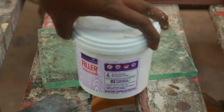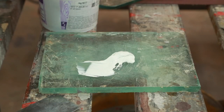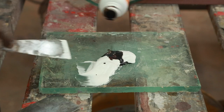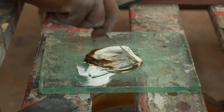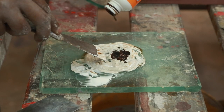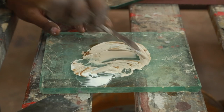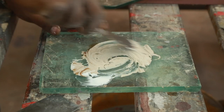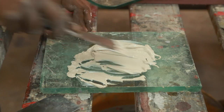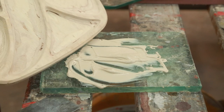To fill the gaps we are going to use this wood filler from Asian paints. This is a thinner-based wood filler which means it dries very fast. I take a small quantity and then because this plywood is of beech color — a little bit of cream color — I want to get this putty into the same color, so I mix a little bit of brown. This is actually walnut brown stain from Asian paints. I mix that well and once I mix it I bring the plywood near it to actually test if the color matches. I make sure I mix it really well so that there are no white stains left. You can see that the plywood matches really well with the putty.